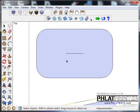And the first thing we want to do here, remember the width of the bit, we basically want to do a center line cut. So I'm going to go up here, I'm going to find my center line cut icon, which is right here. And once I select that, if you look down here, there's a depth percentage. We want to make sure that we're cutting all the way through the center line cut. So using the arrow keys, I can cycle through default depth percentages. But I can also type 110% to make sure it goes all the way through, and hit enter.